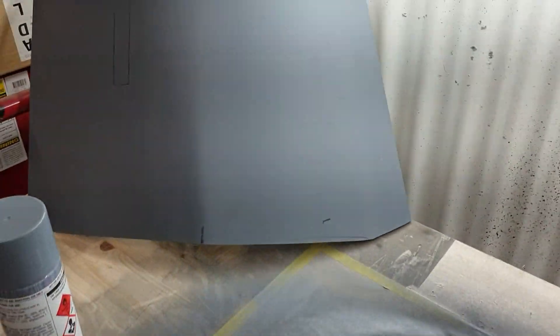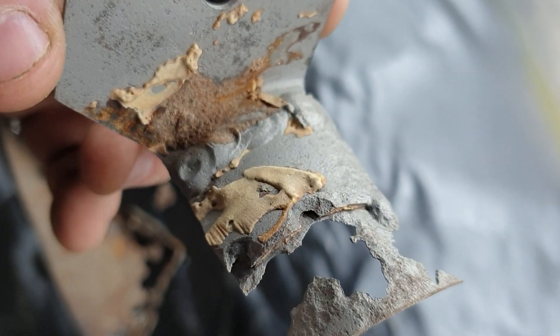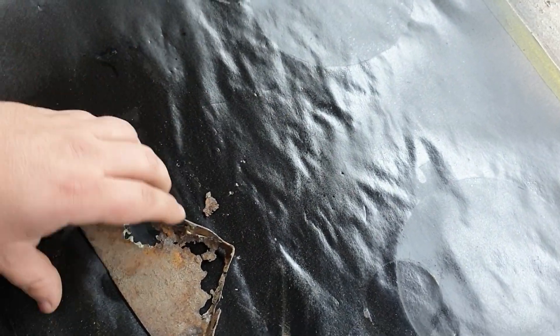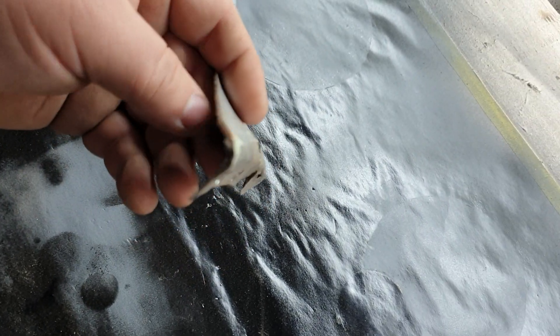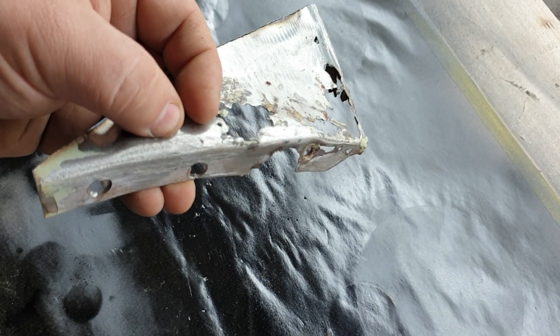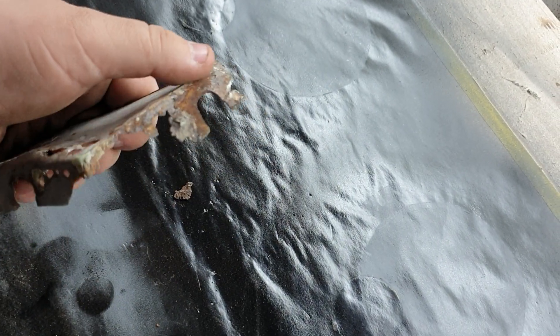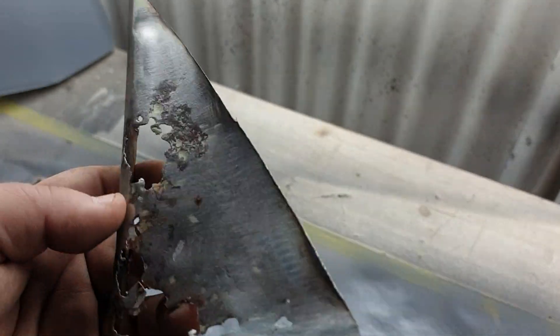Back to these — that's fairly simple. That blob of welds should fall off, and it is basically a shallow right angle, then shrunk along this edge here to give it that curve, then put it in the folder and put another bend there, notch that, and you're pretty much there.